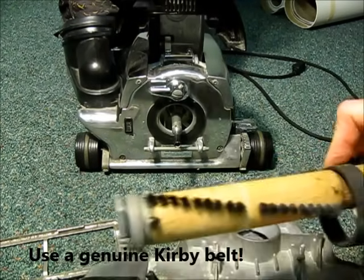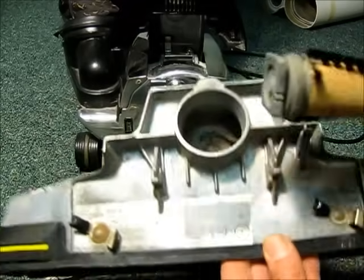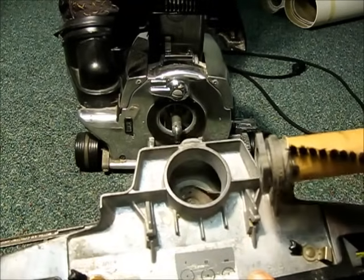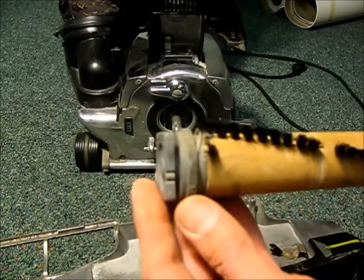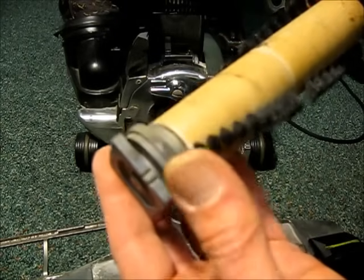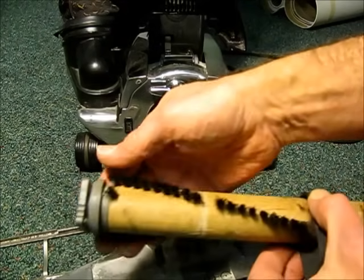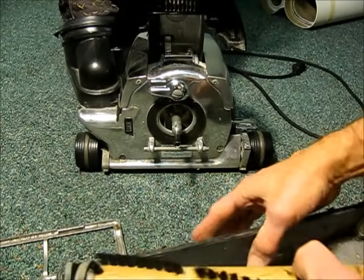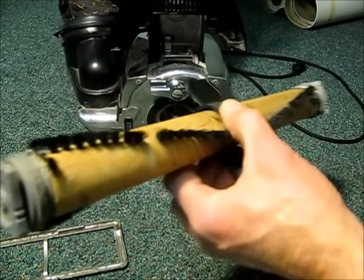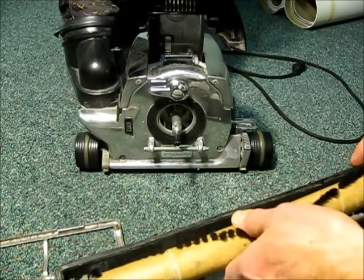The other thing to consider here is the height of the brush. There are three positions: one, two, and three. Position one being the highest, three being where the brushes are lower. As the brush wears, this position can be moved — it's like a cam that adjusts the height of the brushes in relation to the machine. I'm going to put them at position two. There's a large cap and a small cap, and you have to have those in the right orientation, so with the twos facing up.